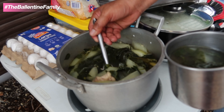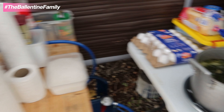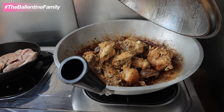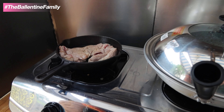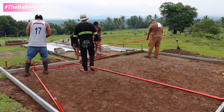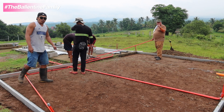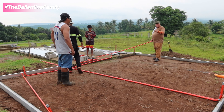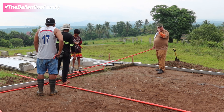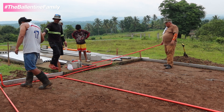Lunch time - manok, we have adobo. Charlie, what's the purpose of this orange thing? It's for all your electrical outlets. In the wall where we're using metal studs it's hard to put wires through, so I'm coming up through the floor and then going right up in between the styrofoam and then putting your boxes in.